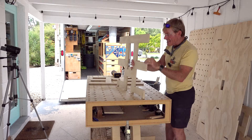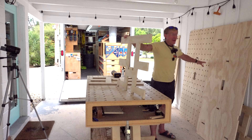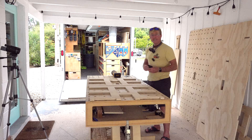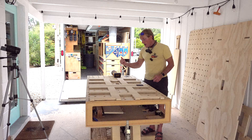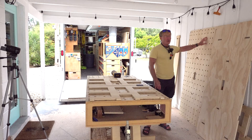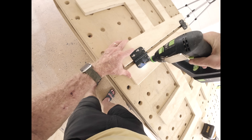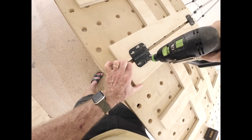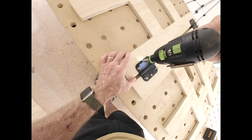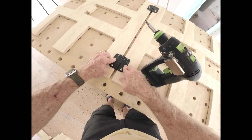I want to emphasize that rounding or beveling the edges on the sawhorses — and actually all of the pieces with the exception of the top side of the 20 millimeter holes — is optional. When I put in the first screw all the way down, I'll go slow and let it seat the hinge so it kind of centers it up, and then the same thing on the other side, which draws the horses together right where they need to be.